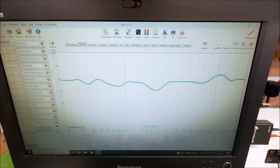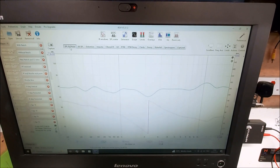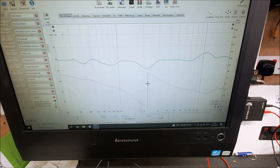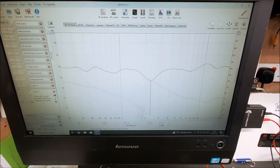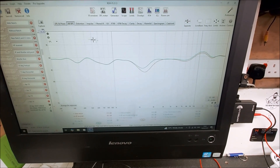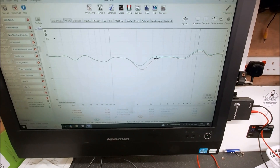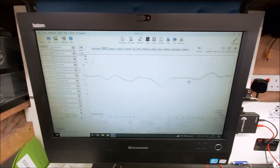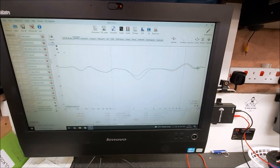I think Mr. Tyler did this on purpose. Looking at the SPL and phase, the new crossover point is at about 2.2 to 2.3 kilohertz; before it was more like 2.5 - just by changing that capacitor value. That seems to be the ideal add-on value without compromising too much of the rest of the response. If I add more capacitance I create a dip elsewhere. So from 200 hertz all the way up to 20 kilohertz, apart from that small bump that drops out as you move off axis horizontally, we're plus or minus two and a half dB - pretty good.